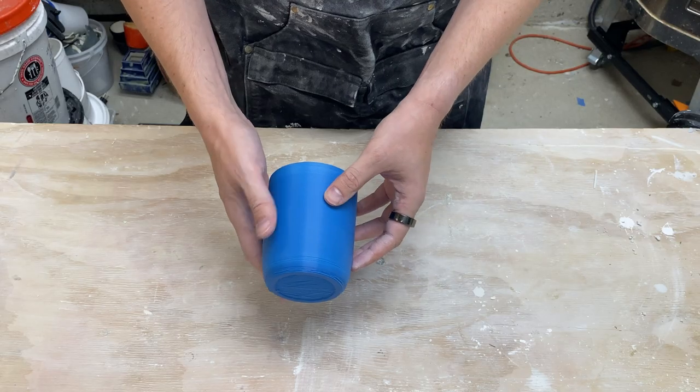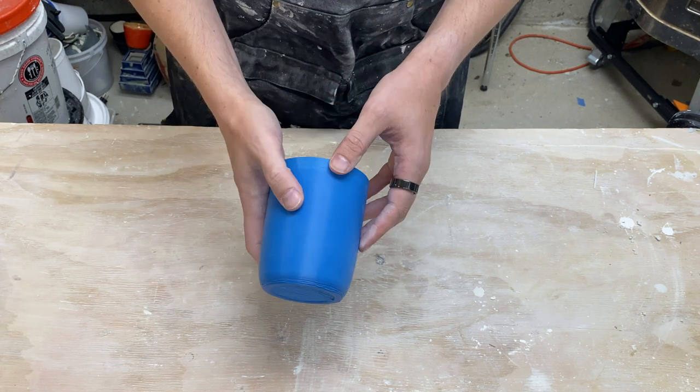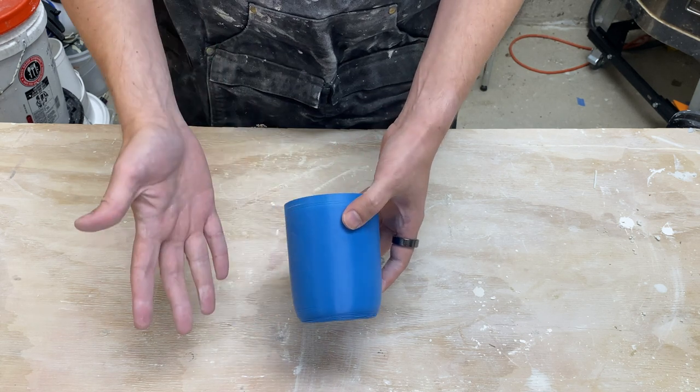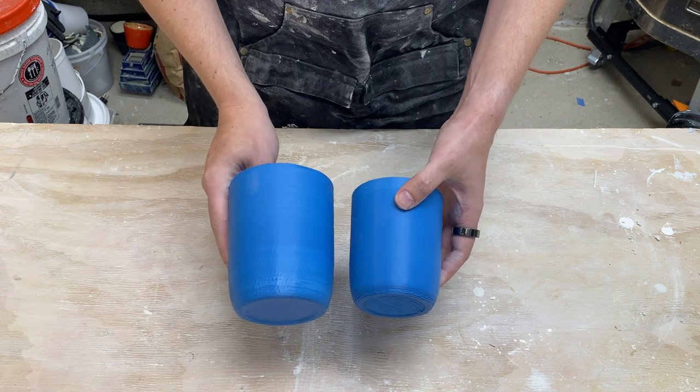It is relatively easy to change the size when we're 3D printing. In the slicer itself, there's a setting that lets you manipulate the size so you can scale up or down. If you have a form that you already like, you can see what it'll look like when it's already shrunk down by scaling it down. Or if you have a pot that you like the final size of, you can scale it up so you know what you need to make a slip cast mold of. So here is a form that I 3D printed. You can imagine finding an existing form on the internet somewhere and wanting to make a mold out of that — this one I actually designed, but I'll talk about that in future videos. I just printed this out on draft settings to get a size. So if I want the finished pot this size, I need to make a mold that's larger — specifically, scaled up by 15% for my clay. That's a relatively easy setting to do in the slicer: I can take this form and multiply it by 1.15 to get this larger form here.